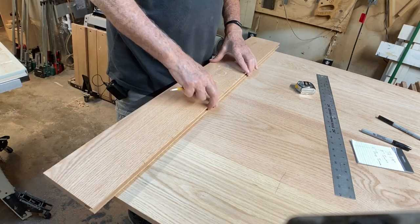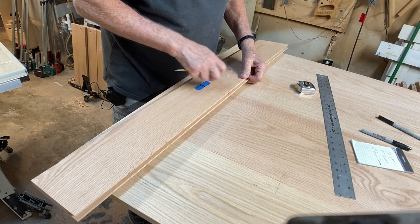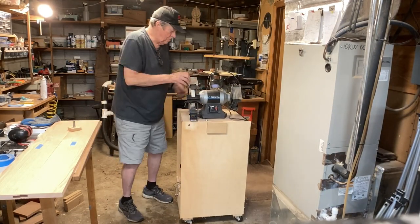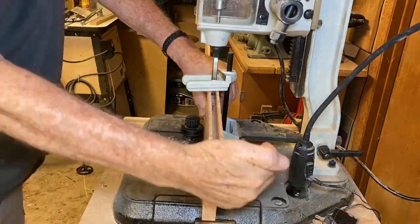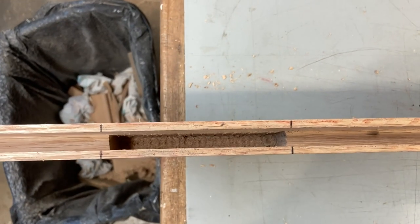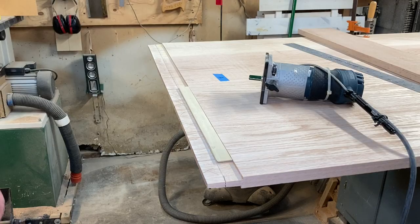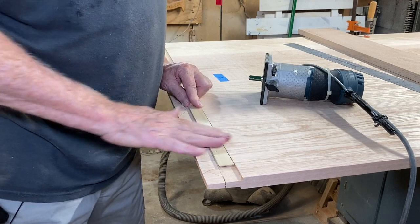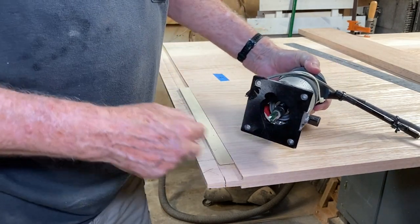I'll take this to my mortising machine. I've already cut a one-inch deep mortise, but these tenons are going to be an additional inch, so I'll have to cut another inch of mortise down in here. I love this little rotating tool stand I made — I can easily switch between my grinder and my mortising machine, and it has a drawer in the bottom to store all the accessories. I've marked where I want to cut between the tenons, and I've got a piece of wood that is one inch wide and the same height as this piece. In my router I've got a pattern-cutting bit — this bearing will ride against the wood and I'll just cut that section out.